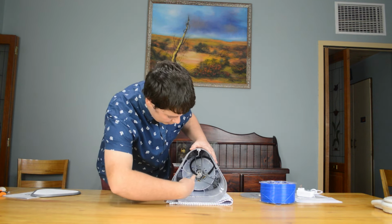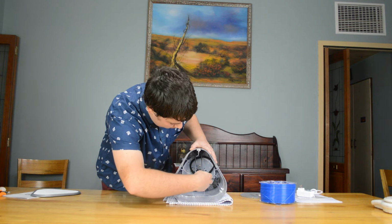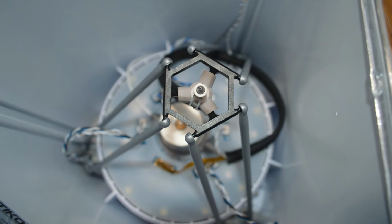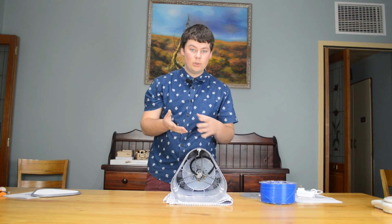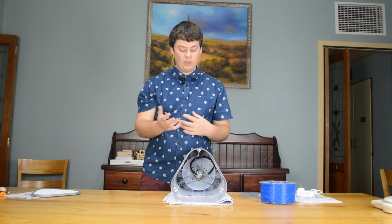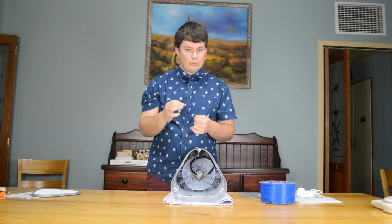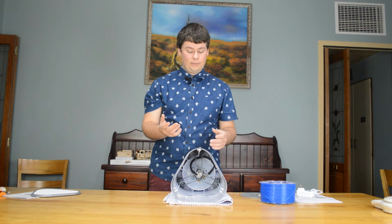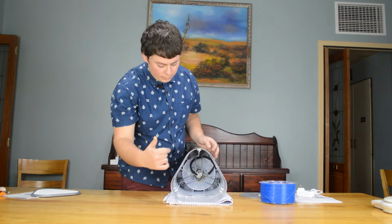So within here, they have the magical hot end, the end effector, and then three sets of arms that run up to the vertical carriages. The vertical carriages are moved not by belts, but actually by a rack and pinion system, which I've only ever seen in the Polar 3D, which in my opinion wasn't accurate enough to get good prints off of. But the Tiko has proved itself a little bit so far. So that's a bit of a look on the inside.